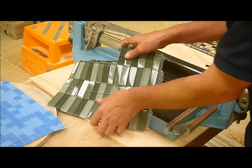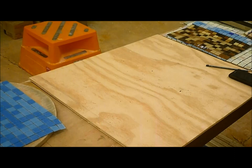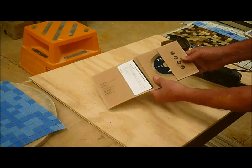Quite a clean cut. But now of course this leaves a very sharp edge. What I'd like to show you guys is angle grinders. Everyone's using angle grinders. This is basically what I would end up doing - using a variable speed angle grinder. That's crucial, that you slow the blade down.